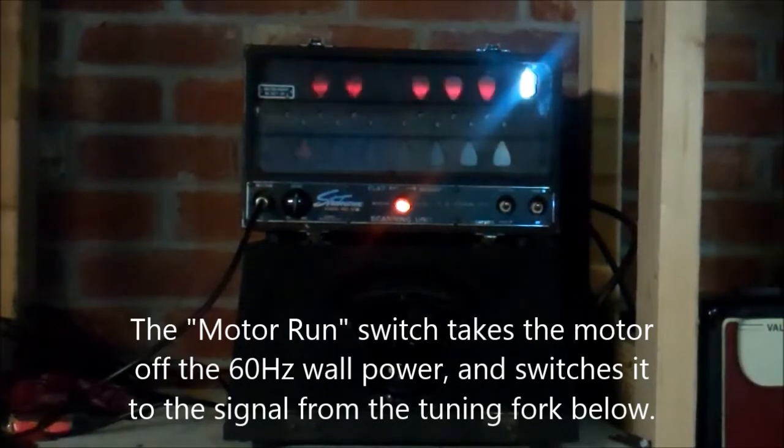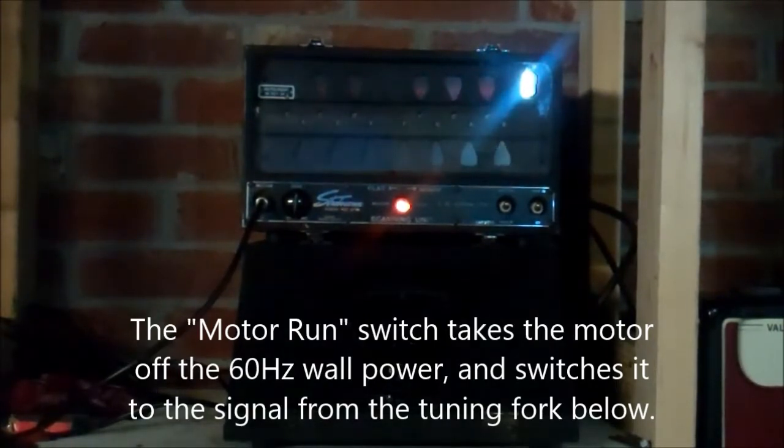We would want a reference pitch for this unit. As you can see, as I'm talking, the microphone can hear me and the neon lights are beginning to flicker. That reference pitch could be a tuning fork, but once you have one of these you realize how much different tuning forks vary. So I usually ask for the tuning fork that they want the piano tuned to. I do have a tuner here that emits a good A frequency. I'll zoom in on our scale up here — that's all the farther this camera will zoom in.